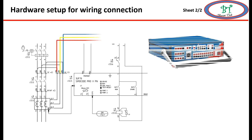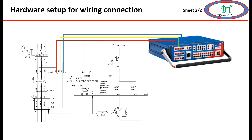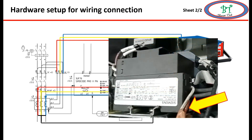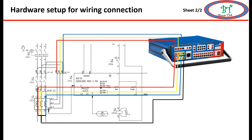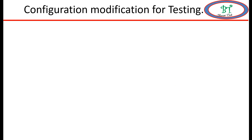In the schematic, the power supply is taken from the bus to the motor. We have the current sensing unit and voltage sensing unit. We are going to connect the voltage to the Omicron kit. For current, we have to make all three phases L1, L2, L3 into the CT and the other end of the CT has to connect to the Omicron kit; the other end of the wire has to be shorted and connected to neutral. For tripping feedback we take it from any fault trip signal, or from the stop command on fault. I am taking from the stop command given to the K1 contact, and I have the K1 free contact for tripping feedback. The full load current is 19.03A which is a little bit higher, so I am using two current sources connected in parallel.